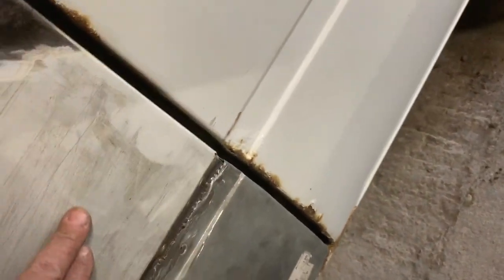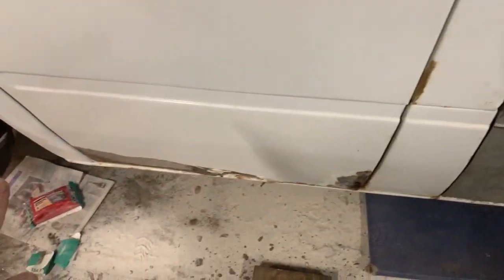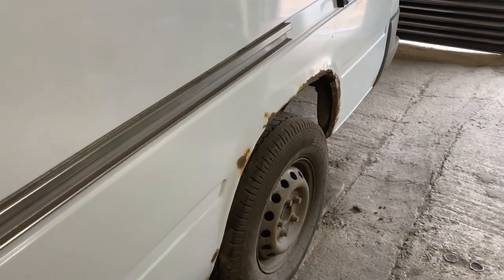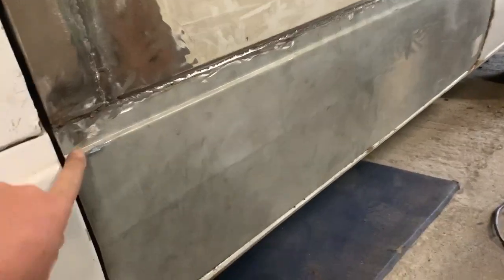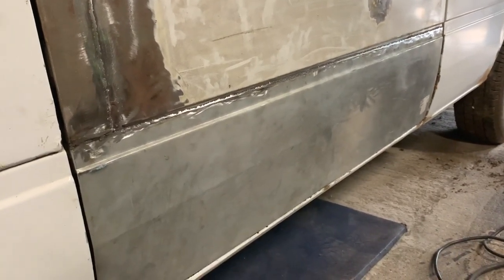The line's nice down there — it will push in a little bit on the bottom, but the line's good along there and good up there as well. I've got to weld a little bit on the end there, but I'm pretty pleased with how it's fitting. That'll be the hardest job of the van done. I have got to replace the bottom part of the door because that's all rusty — tried to grind it and that happened. The front door I only have to get in line, but the side loading door is much more difficult because it has to come out, slide along, then shut and everything has to clear. I've sorted that now, so I'm pleased with that.